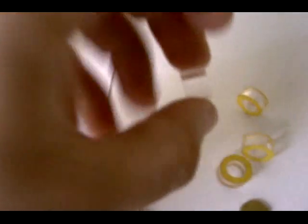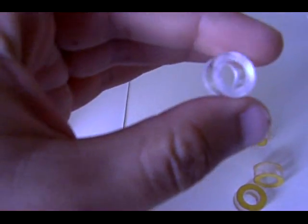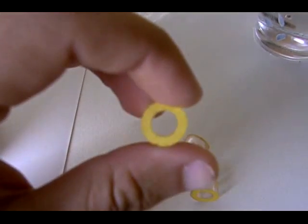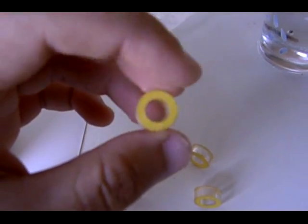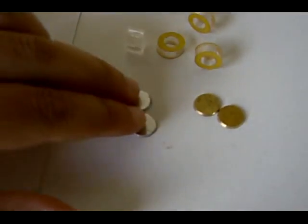We also need a piece of vinyl which will finish off the battery later — we wrap it around and it holds everything together. The main parts of the build: you need to find yourself some plastic tubing. I've found an acrylic pipe which I've cut down to 6mm cells. 6mm cells works out pretty good because if you build them up and pack them, they'll equal the length of a AA battery, which means you can use it in some devices around the house. The yellow you're seeing is the double-sided tape which I've put on and cut around. These will hold the brass discs and aluminium discs, which will be your negative and your positive. The brass discs play the positive part and the aluminium plays the negative part.